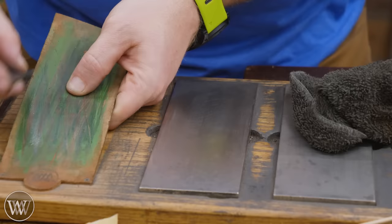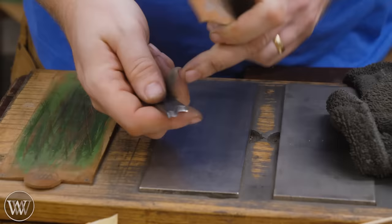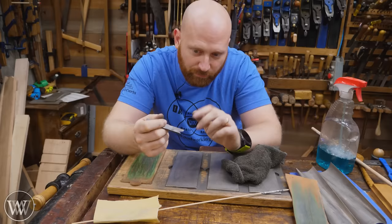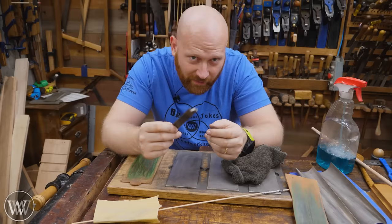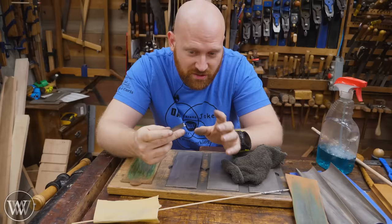Then take it over to the strop and do the same thing again — the flat sections, one and then another. Another nice thing about that horse butt is it holds its shape really nicely; bend it to that first concave, then work a little bit on that convex. For that tiny concave, use the edge of it and push it in to get into the surface. If you're using this cutter a lot, you may want to cut a profile into the edge of a board and use that as your strop — put compound into that wood, particularly MDF or pine, and use that as a profiled strop to hit everything evenly. It's very rare that you're sharpening one of these constantly; usually it's something you sharpen once every few years, if that.